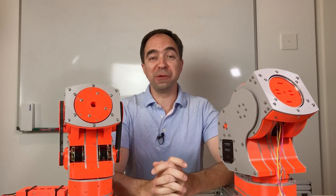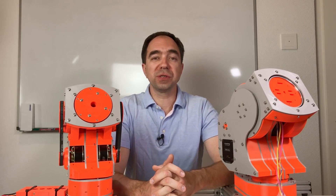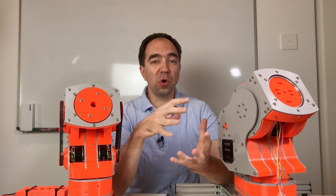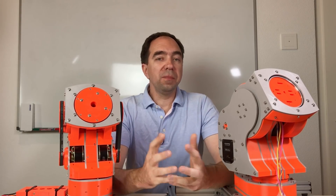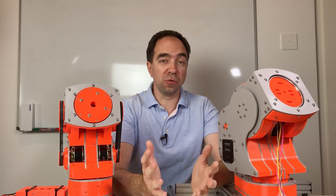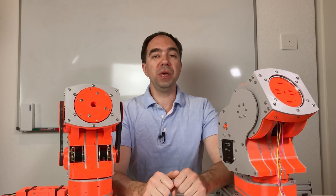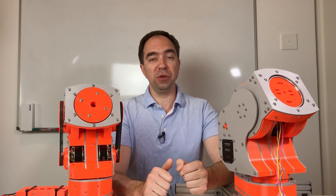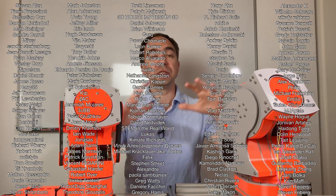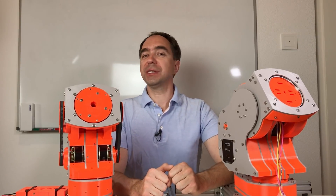As you saw, both shoulders work really well, and both use quasi-direct drive technology. Here we essentially built our own planetary gearbox, and here we use the MIT mini Cheetah-like actuator which consists of a planetary gearbox, motor, and controller in one compact form factor. In my next video I will continue with the build of this robot arm, and maybe one day we will build a robot arm out of these actuators too. To accelerate this, you can support me by putting a like on this video, leaving one or several comments, or by supporting me via PayPal or Patreon — all the links are in the description. Here are the names of the people who supported me on Patreon. This support makes a huge difference, and the more support I have the faster this will grow and the quicker I will finish the robot arm. Stay safe, good luck with your projects, and see you next time!